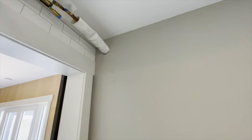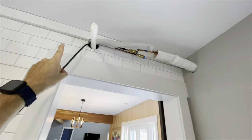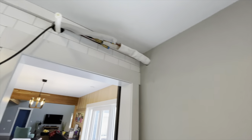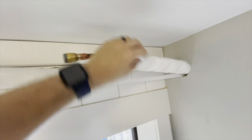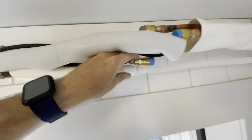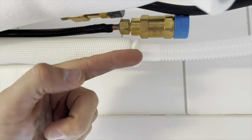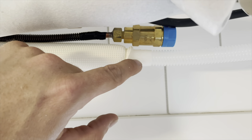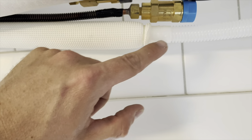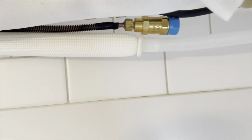Going forward, I think I'm definitely going to use the three-and-a-half inches. I can go ahead, connect this stuff up, get the condensate, and run the wiring through now. I got my wiring through my hole as well as my condensate drain. You can notice right here on this drain — this extension goes over top so you get proper shingling when draining this way. These nubs on here hold this pretty snugly, but I'm going to go ahead and tape this with some good duct tape just to be safe. As long as you've got proper slope and it's connected all the way in, you should be good.